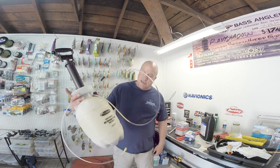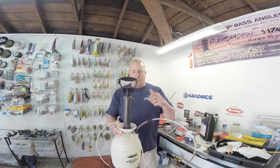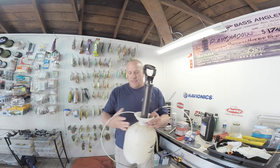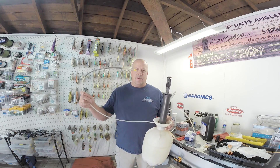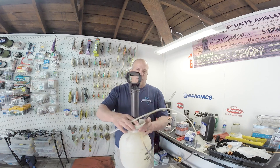There are two ways to get the oil out of the boat. You can take the whole thing apart, drain it — you have to take the sides off the cowling of the motor and everything else. Or you can pick up a pump like this. This is a vacuum pump, an oil change pump high speed. You basically pump it, it creates a vacuum. This gets the tube down into the dipstick hole and it'll suck all the oil out real easy. If you service your motor regularly and you're not having any problems, it gets almost all the oil out.